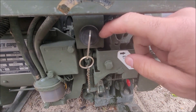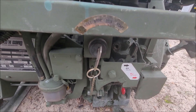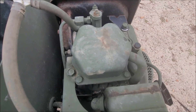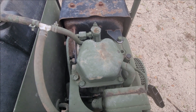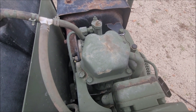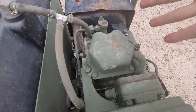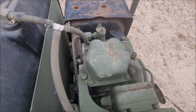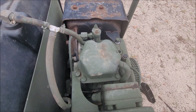It does crank. The lever down here is very stiff — I've got to pull this apart and see if something's jammed up in the springs. But it's in run. Unlike the Yanmars, even though it looks similar, there's not a decompression lever, which I kind of do not like. But it does pull start pretty good. The way this one probably works is it has an auto decompression lever — so when the RPM gets low, it's automatically decompressing, and once the RPM kicks up, it allows the valve to seal, so you don't need to mess with it. I like having that decompressor lever on top, because if you have a problem you can push that down and it'll shut the motor down — you lose compression in case it starts to run away.